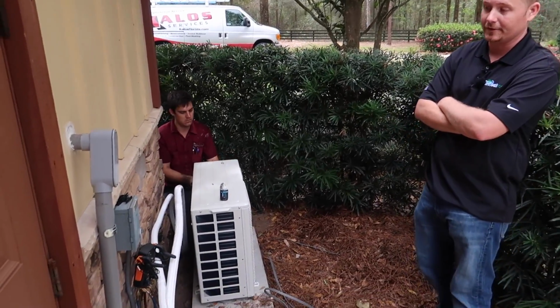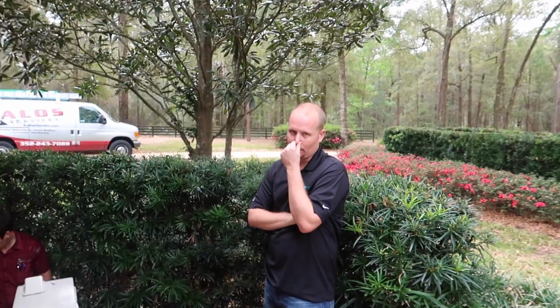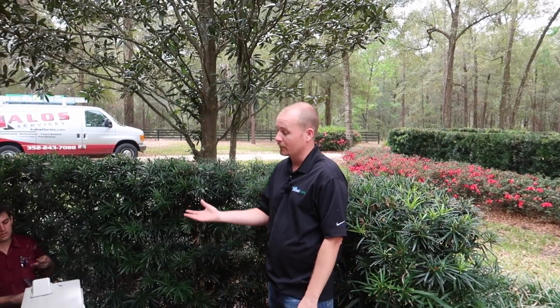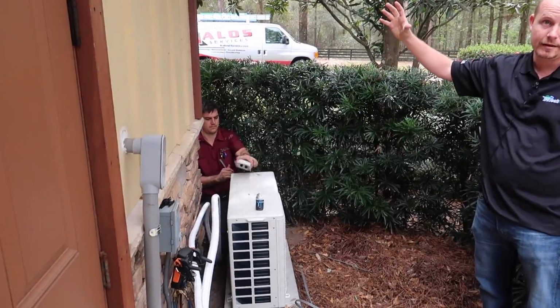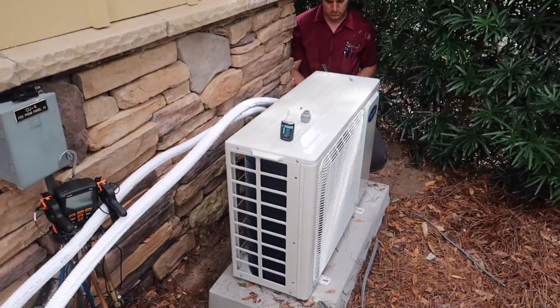And this is what we would do in our house if you didn't have so many interior walls and stuff. Well, room by room. Yeah, we have big houses with all these rooms, and that makes ducting more feasible. But from an efficiency standpoint, this has no duct losses, because you just have the unit inside. In a typical house, you have so much loss just running air through ducts all over the place.